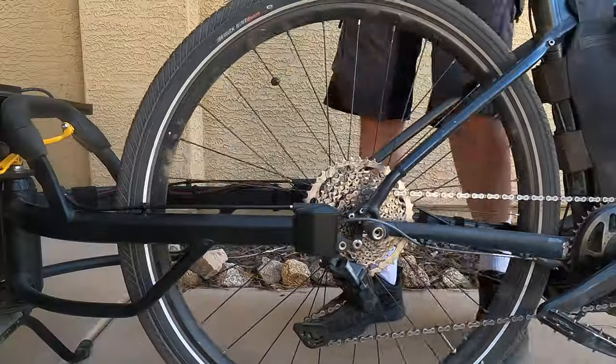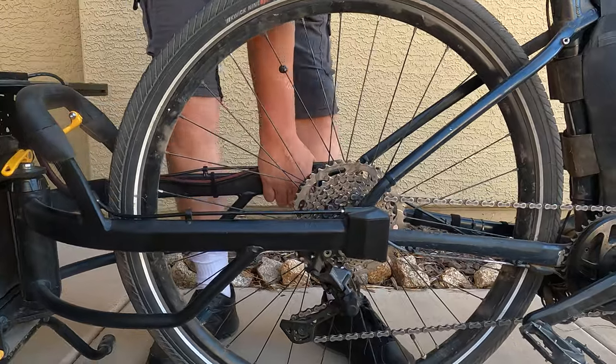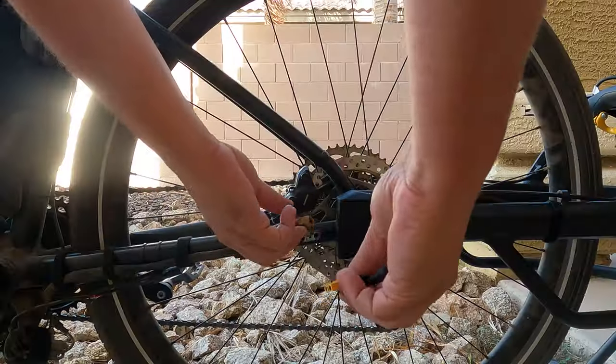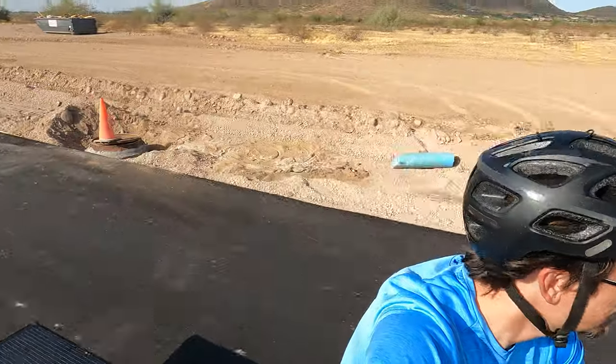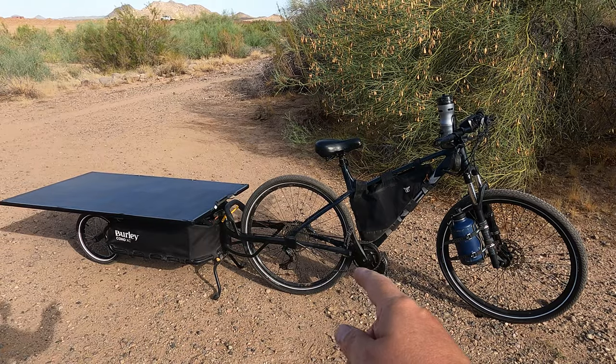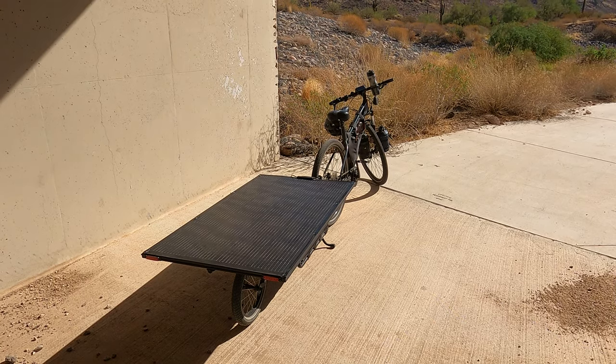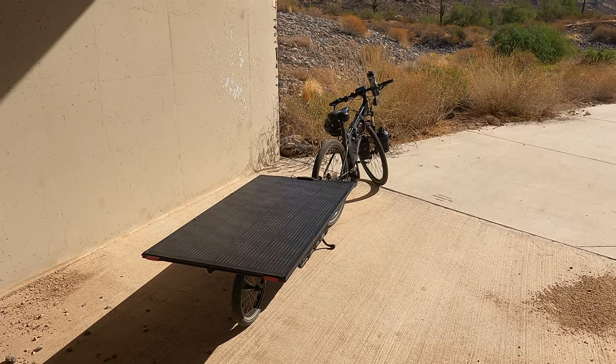After testing, if I keep between 15 to 20 miles per hour I can pretty much go as long as the sun's out — I kind of made the forever e-bike. I do have 55 amp hours of 48 volt batteries in there, but that's just because I like a good gas tank for when I want to go faster or up a steep mountain. Thanks for watching — until next time.